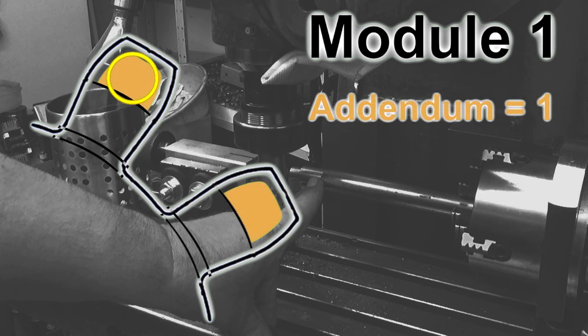In a module system, the gear tooth is divided height-wise into three parts. The topmost part is called addendum, and it starts from the middle of the tooth and extends to the very top of it. The basic value of this height is 1, so if I make a module 1 gear, then the height of this part is obviously 1. Consequently, if I would be making a module 0.5 gear, then the height of addendum would be 0.5.